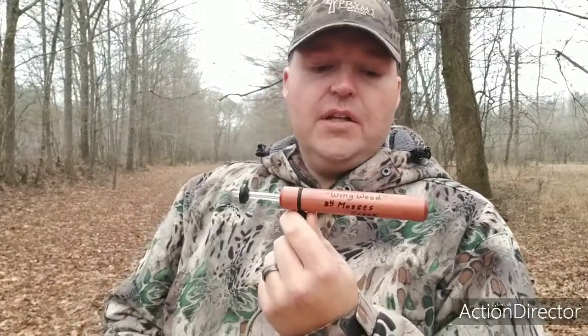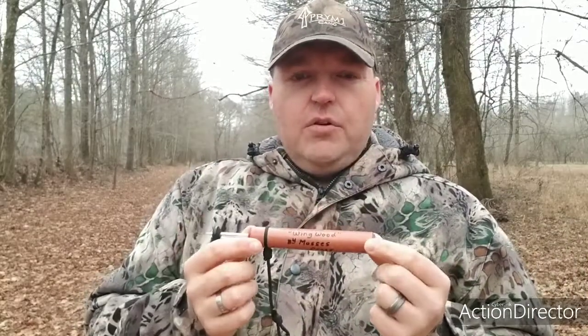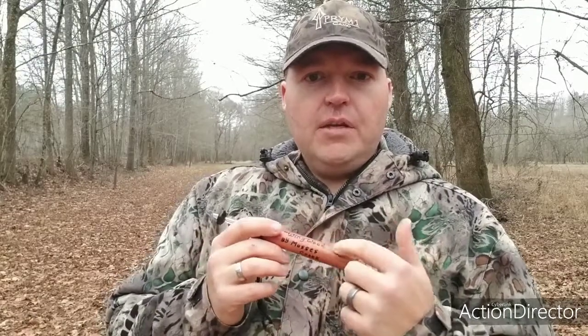This call is a little more than just a simple piece of wood with a hole in it. This call is a very tedious call to make. I have to put a lot more into it than what a lot of people would imagine. It has to do with the length of this barrel, and also with the hole that's up in the barrel. That hole has got to be made right, especially up inside the call, or the call will not sound right — you will not get those break over yips. You're just going to get a bland, straight out sound.